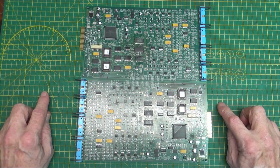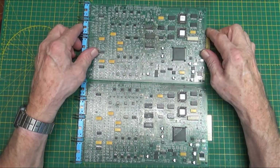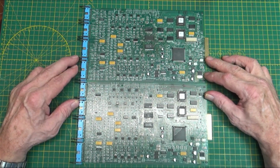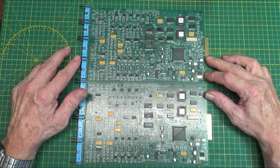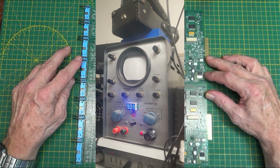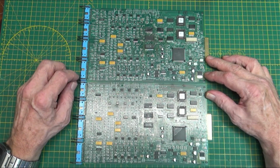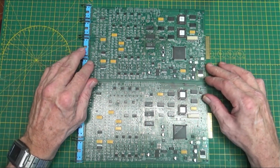back to the machine. So I got two of them here, and since they had different problems, I brought them home and used a variety of different pieces of equipment, the biggest of which was the Mr. Carlson curve tracer that's built into an old W66 RCA scope. It gives you a good curve that doesn't actually mean anything, but if you've got two of them to compare, it pretty much can't be beat.